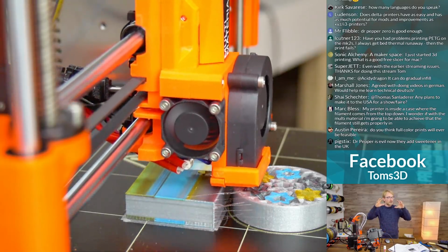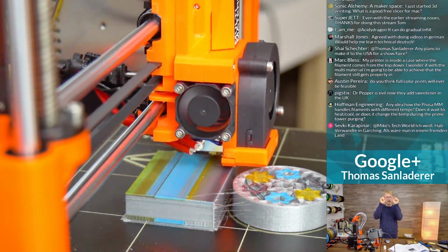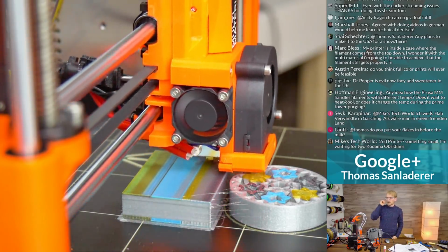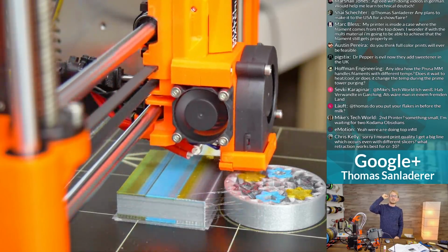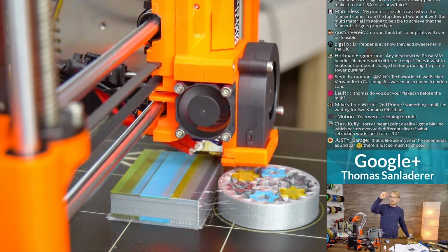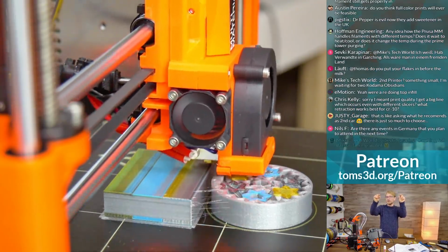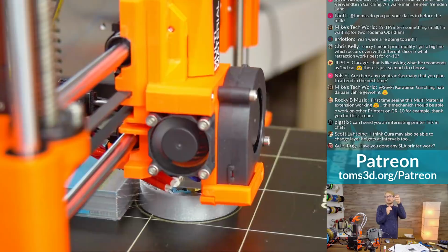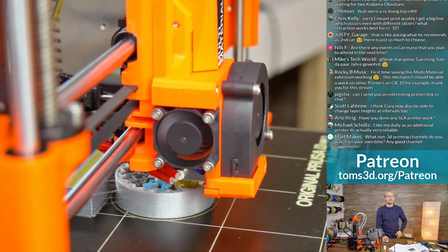It does either cubic subdivision, a shell on the outside of your part where it uses little cubes, and then the further it gets towards the inside, it has bigger and bigger cubes with more and more air in them. Or you can also do, I don't know what the feature is called exactly, something where if you set 25% infill, the top layer is going to be 25% infill for the first 3-5 millimeters, whatever you set it to. Then it's going to have one section of 12.5% infill, and then 6.25% infill, etc. You can have that step down towards the inside of the part, and that's very, very good to have.